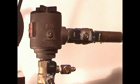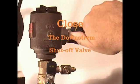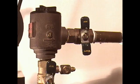No-flow validation test. The no-flow or static condition test is conducted to determine if the spill-resistant pressure vacuum breaker is in a static state at the time of the test. To evaluate the static state, request permission to stop the flow of water downstream. Once permission is granted, close the downstream shut-off valve.